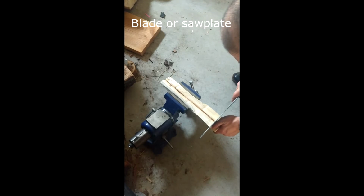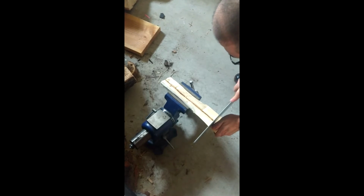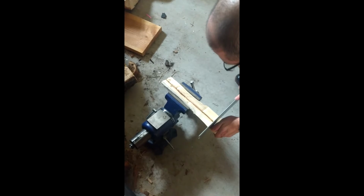I put my thumb not on the downward where it's going to cut me, but on the actual metal itself, not the teeth, but up on the, I'm not sure what the top of it is called. I line it up here, I make sure that I have a good line. And then with this, I'm just making my initial line, so it's marking where I'm going to be cutting. So again, I'm drawing back, so this actually is not cutting, it's giving me my initial mark, if you will. Now that I have my initial mark, I know the direction I'm going. And mind you, be careful when you do this so you don't get a splinter. But we got a good start going, we got it in place, we're lined up, and from this point now I can slowly, gently start cutting, and as you'll see, it shouldn't go too bad.